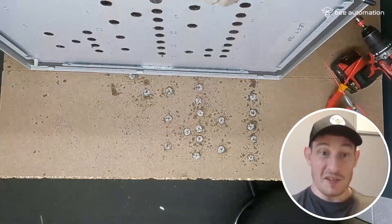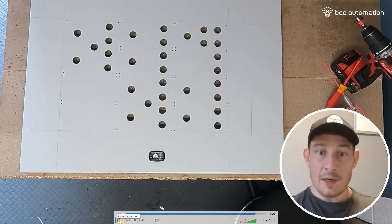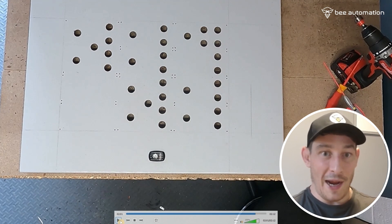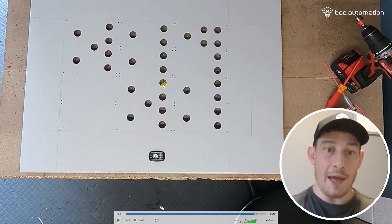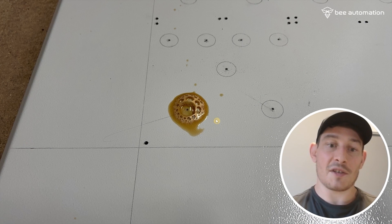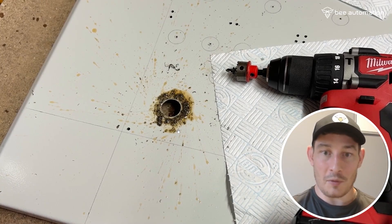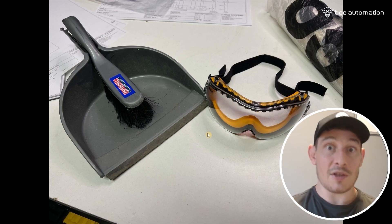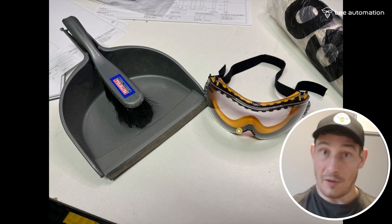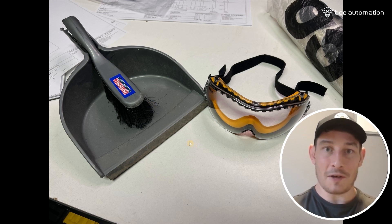Once that's done, it's just clearing all the debris away and giving it a good clean with some methylated spirit and a lint-free cloth or rag. Be careful not to scratch the paintwork on the front by dragging swarf around. I just squirt a dollop of cutting fluid around each hole saw cut — that's what it looks like. Be sure to wear eye protection; I choose to use goggles because swarf has kicked up into my eye before even when wearing glasses.